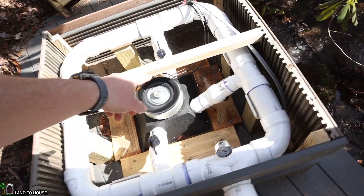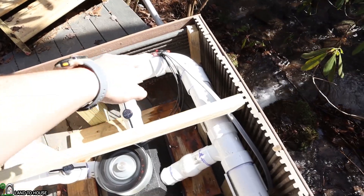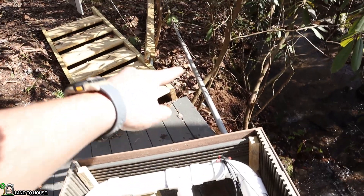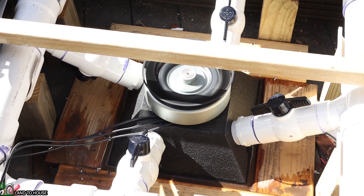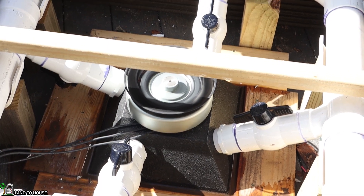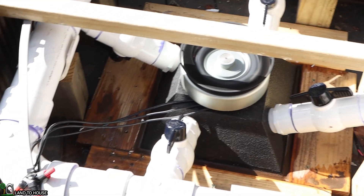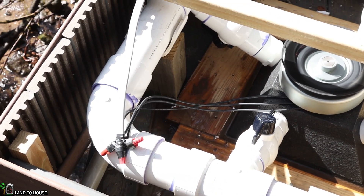Three-phase power comes out of this. As you can see, there are three wires going around here, and that hooks up to this exterior wire. It goes through conduit onto the house. The permanent magnet alternator has magnets that cross over coils, and when that happens, AC power is produced. There are three wires leaving that PMA, and those are carrying three-phase AC.